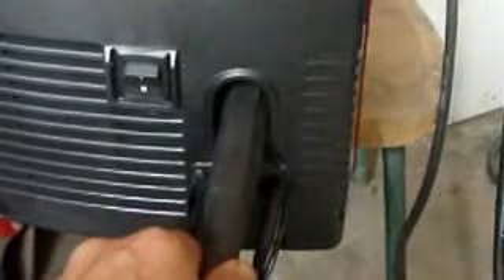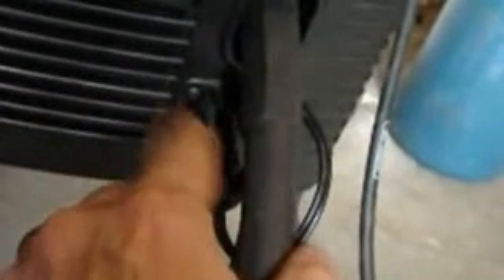When I plugged in my gun, there are two o-rings on the cable. The first time I didn't push hard enough, so make sure you push hard enough that you feel it go clunk and it'll be in. Secondly, on the gun wire there's a fitting that plugs in as well — you have to turn it to find where the prongs go. There are four prong holes and two prongs, so just guess where it is and tighten it up. Your ground cable comes with it and goes in underneath, tightened on with the wing nut on the inside.